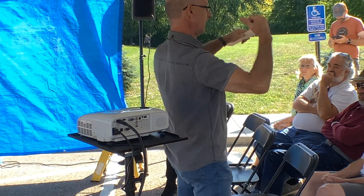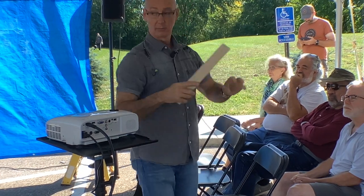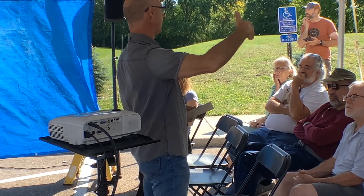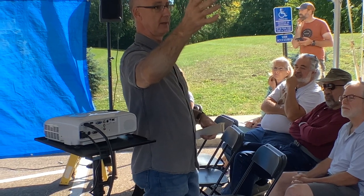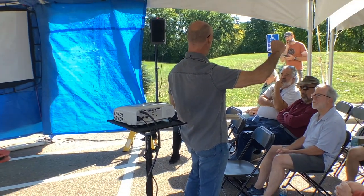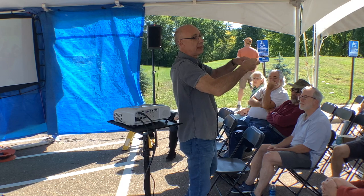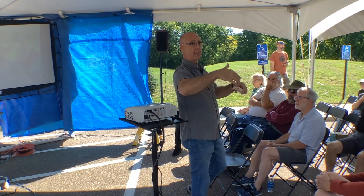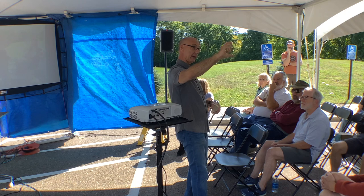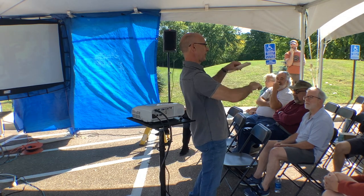The other importance of that is matching the bits to the work you want to do. If you're doing 3/4 inch doors, you want to buy a bit set that hits that range. Generally the bits will say for 3/4 inch to 7/8 inch material or whatever. We can get that same profile in a smaller scale. A lot of companies call them junior sets, where they work in 1/2 inch to 5/8 material. This wouldn't work in 1/2 inch material; we can't fit this profile in that thin. If you want to make an entrance door or a passage door for your house, 1 3/8 or 1 3/4, we have to go up in scale to a bit set designed for that kind of profile. So when you buy the bits, make sure they match what you're trying to do.